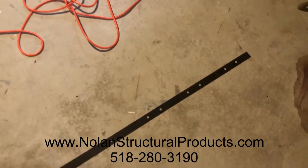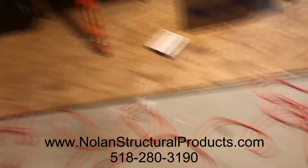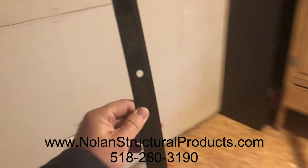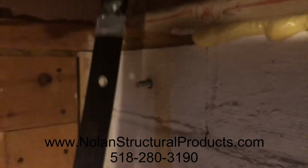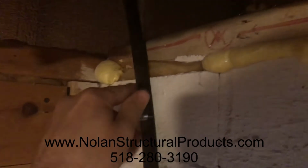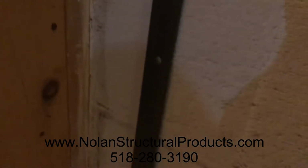So these straps are different on both ends. The bottom has 3 sets of 2 holes. The top looks slightly different. There's 2 holes and then 1. And which hole you use depends on if your top block is an 8-inch or a 4-inch like this one. For the 4-inch, you use the 3rd hole on the strap, because this top piece is going to bend over and secure to the sill plate. Another way you can make sure you have it right is once you're using the right hole, all the other holes should line up with the center of all the blocks below.